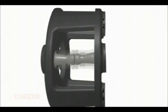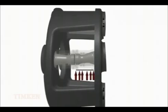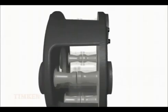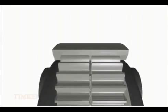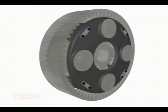This unique twin cantilever construction also creates a bending pattern that maintains gear face alignment as indicated by the arrows at all load levels. Since misalignment is virtually eliminated and unit loads are reduced by a factor of 2, the contact stress pattern can be more reliably positioned along a narrower gear face, resulting in fuller utilization of the gear's potential capacity. Use of the Flexdrive also improves load distribution among adjacent planets.